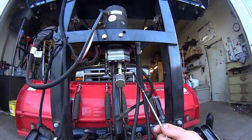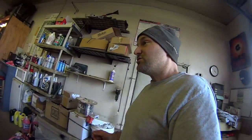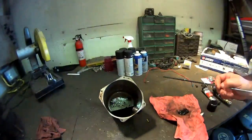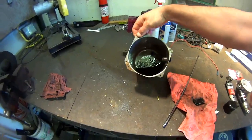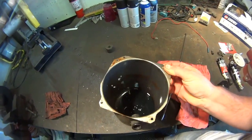So don't be afraid to take those four off, pull this down, and clean this tank. It's very important to clean the tank. Because if you don't clean the tank, you will get sludge up into the pump, into your pistons, and you'll actually destroy a lot of your components. This is basically what you'll find in the tank — hopefully a lot better than this one. This one's pretty bad. There's a lot of sludge in here.